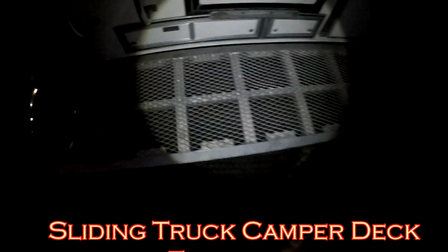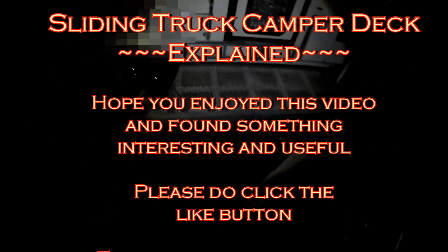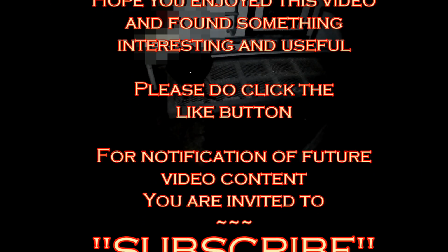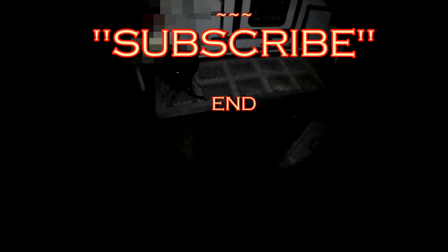81 inches wide, 25.5 inches deep, 2x3 box aluminum on the outer frame, 2x2 box aluminum in between, 5 of them, and then 1.5" box down the center, and then 1.5" angle all around the perimeter. Very simple construction, very, very useful deck. Okay, so hope that answers your questions.